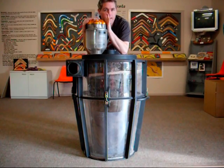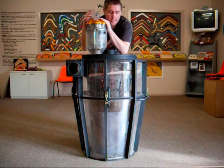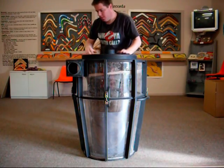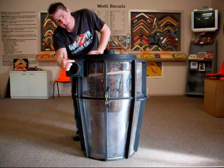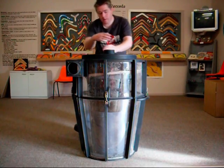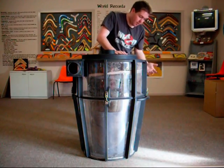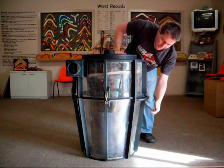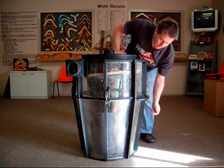This is what I intended to create, and this is my end product right here. You've got your inlet port here — the air will go around and cycle around. The heavier dust will end up at the bottom, and the finer dust should end up in the bin on the inside.